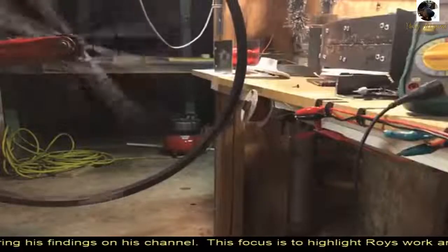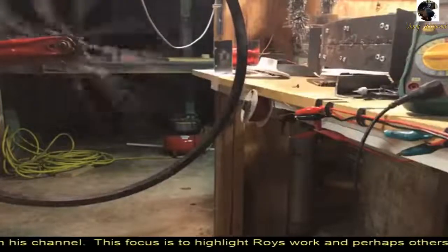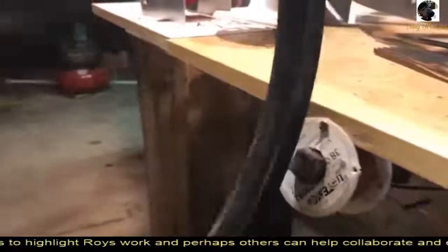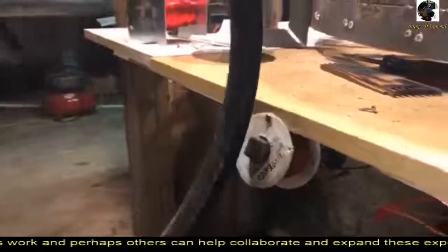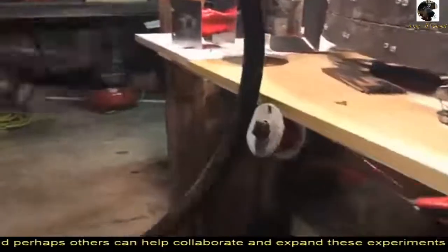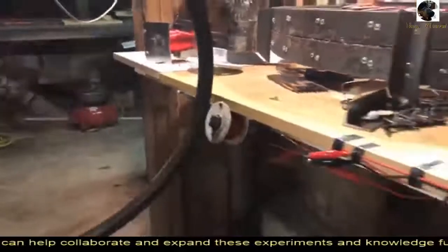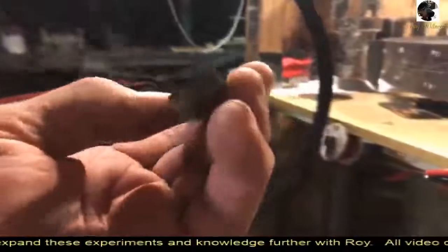Well, it beats the heck out of using a reed switch, and it also beats the heck out of using a relay. On the core here, that's laminate that I shoved inside here. I got 150 feet of wire. It's a bifilar using 26 gauge and 26 gauge and I believe 28 gauge, 150 feet each evenly. And I'm using the laminate cores, little laminates right there. I'm shoving them in there, so they're making it perfect.